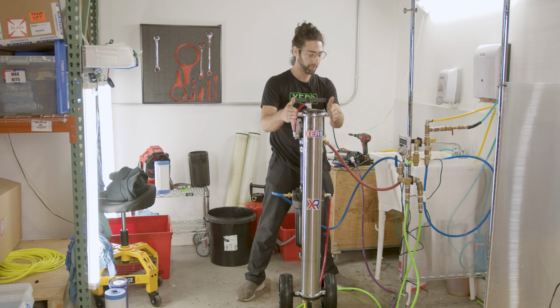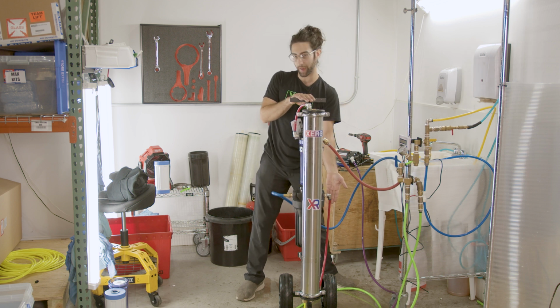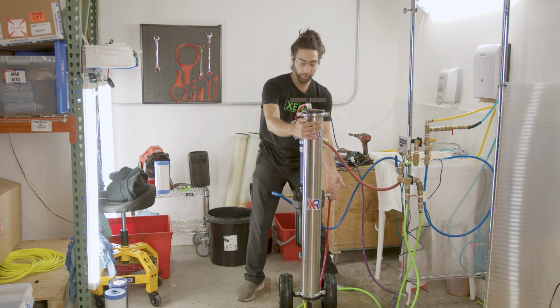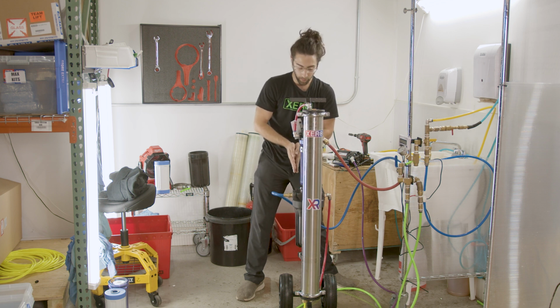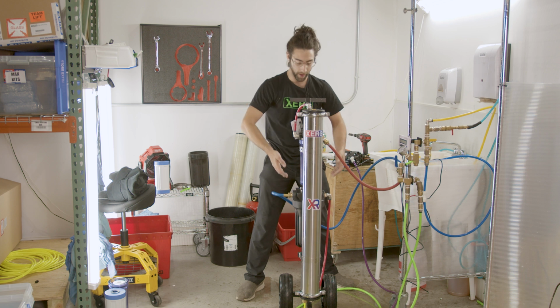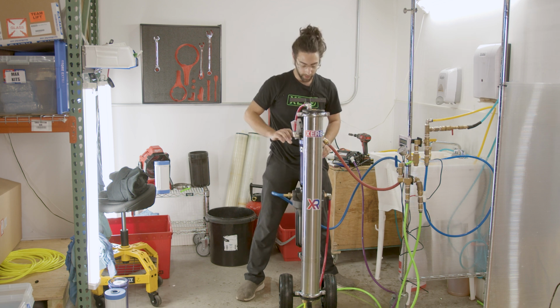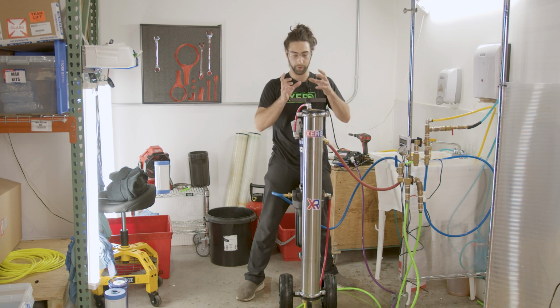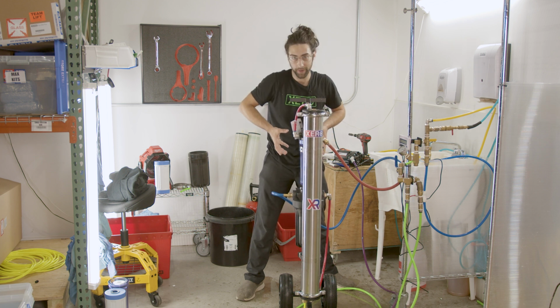Now let's say theoretically, with the source 81 ppm, we get the result of 6 ppm, membrane is performing, but for some reason, outside of the system, we're getting more ppm, we're getting 9 ppm. The issue is now localized to the resin chamber, meaning you must ask yourself, is the resin chamber properly situated? Is the resin chamber properly filled with resin? Lack of resin means lack of purification.